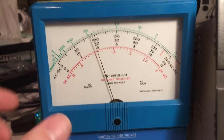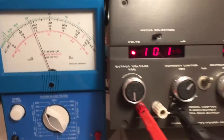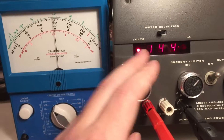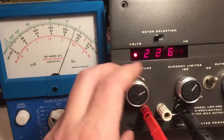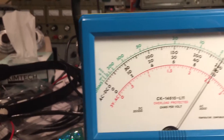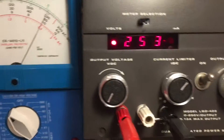Actually, this meter is designed to lay flat — that's why it's not accurate. It is calibrated to lay flat per the instructions. So in checking this out, can it go up to a full 250 volts? Sure enough, 251, 252 on that meter. This one says about 250, and if you look at the Fluke, it's 254. Looking good on that channel.